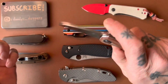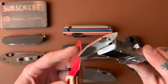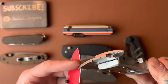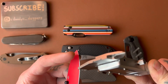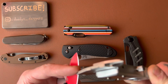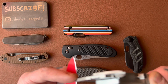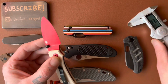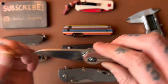That's pretty impressive. Wow. That's another thing is, it doesn't necessarily have to be consistent throughout the whole edge, but when it is, you can tell that it's a precision made knife. Whoever ground in the bevels, not the edge bevel, but the bevels, did a really good job. Unless it's some kind of wacky compound grind or something like that. So the Baby Banter, I'm just double checking because it doesn't feel thinner than the Kaiser. But I guess it is because I'm getting 16 and this was 15. So this is now the new thinnest behind the edge knife in my collection.